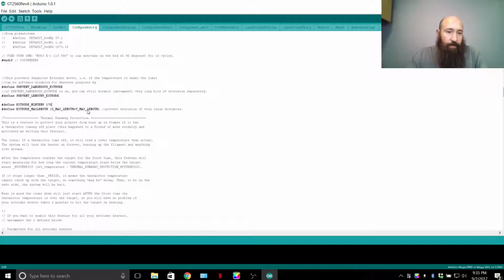So back to the minimum temperature. When you're extruding, and say you're doing a rapid movement, or you have a nozzle that's using a lot of material, in order to prevent the dangerous extrude, it will calculate the BTU thermal energy contained within your hot end plus the energy that it's feeding into it via the heater, and then try to figure out via math and an algorithm how much filament is going to be fed in. So if it knows it's got 100 millimeters of filament coming, it knows not to use it all. And if it comes in all at once, then the secondary redundancy to stop is that when the temperature hits 170, it's a hard stop, like saying, okay, that's it, I'm cutting the printer.